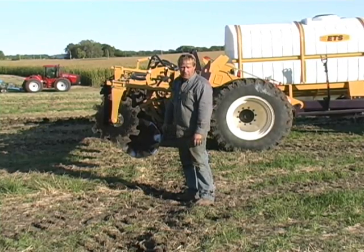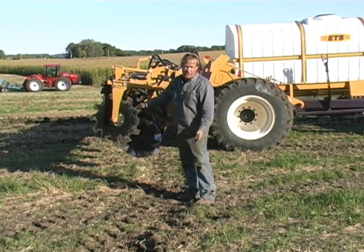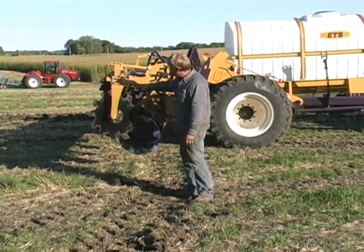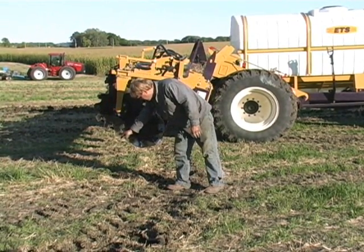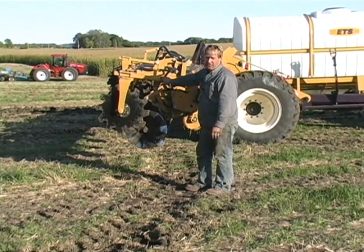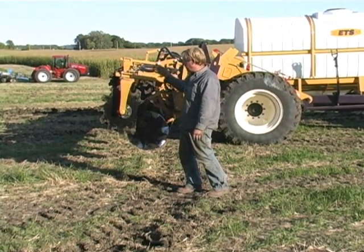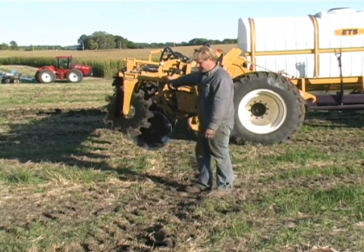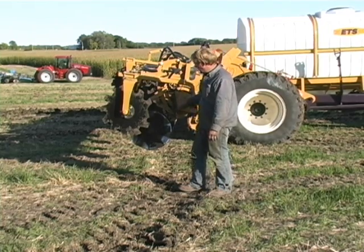They're virtually impossible to shove into the ground much more than in real loose conditions. If you're running a lot of pressure into the bags, you can get them in an inch, inch and a half — that's it, they're just not going to penetrate more than that. It's hooked to the working coulter, and the distance from the bottom of here and the cutting depth of the wavy stays within about three sixteenths of an inch, whether it's fully in its down position or fully retracted at the upper end of the nineteen inches of travel. So we do have depth control on the wavy.